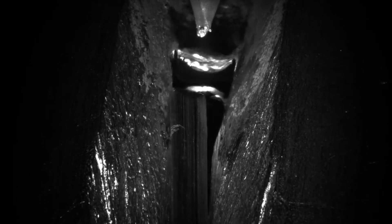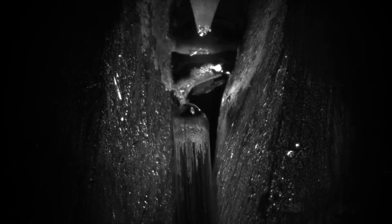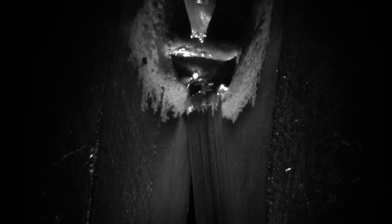You can see what's happening — the arc strikes right there, and then you see it turning white as the oxides are loosened up and flaking off. Look at that exceptional stability of that puddle, and how the tungsten maintains a sharp point. The Independence 251 is just next level. The nice thing is that your torches, your wireless foot pedal — everything from your whole dynasty of welding equipment — fits right on that Independence 251, and you can make pretty aluminum welds like that too.